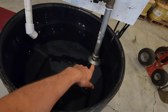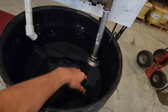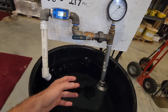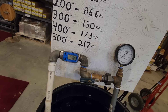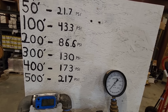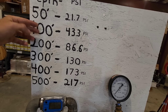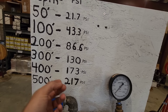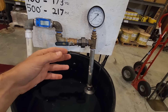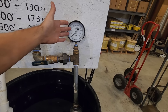I have seen these pumps used in bored wells because bored wells typically have a maximum depth of about 50 feet, and you could put this pump in a bored well and it would shut off a pressure switch. Another option if you purchased this pump and are having trouble — you could go buy a 20-40 pressure switch. That means your switch would cut the pump off at 40 PSI, giving you another 35 PSI to work with. So you could set the pump at 75 feet and run a 20-40 pressure switch and theoretically the pump should be able to cut itself off. But if you remember my other flow tests, we were getting pressures above 100, 120 PSI — some pumps are building towards 175 PSI.